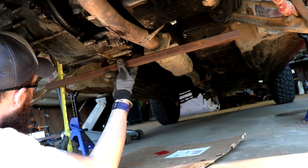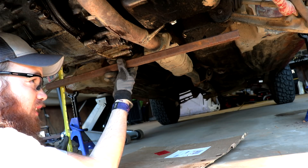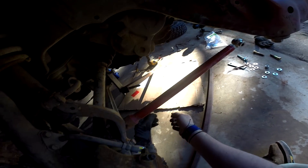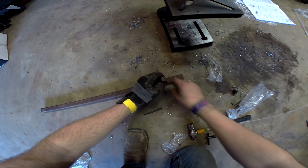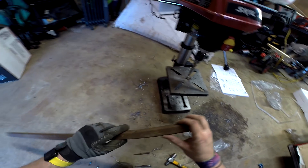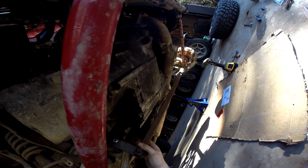It looks like a four-and-a-half inch bracket there will keep me clear — actually I think I want to cut the brackets about five inches and see where we are. That way I can mark my hole on the other side. Go ahead and center punch it, then put a little drill through it. I could get fancy and measure center-to-center and make sure it's on point, but I'm in the business of fudging things. Let's see how close we got — I can live with that. That's not a bad height, not bad at all.